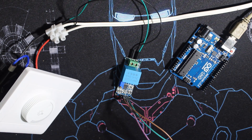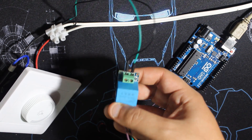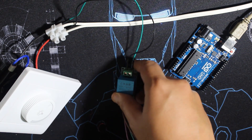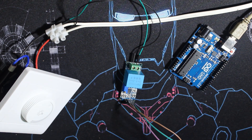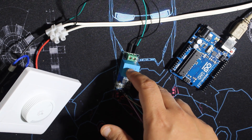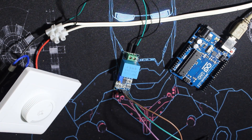The important thing is that we won't have any complex sketch wiring — just this module and the inputs where we want to measure voltage. What's more important is that there is no rectification of the signal. We're going to keep the same shape of the AC signal — we'll have a perfect sine wave and process it with our Arduino board.